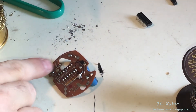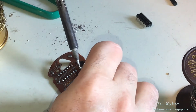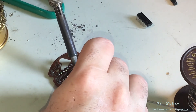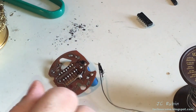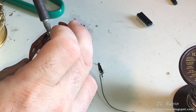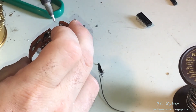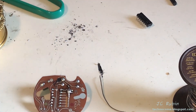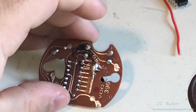Special attention will have to be made for this pin where I did some repairs. I have to replace the soldering bridge right over here that was broken. I've put in some small lengths of wire as a bridge to solder across, and I believe the repairs are good.